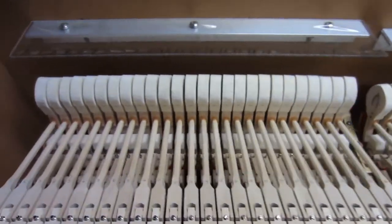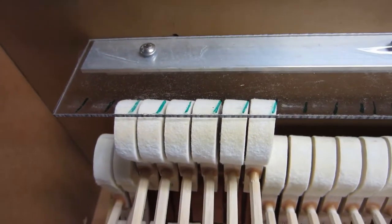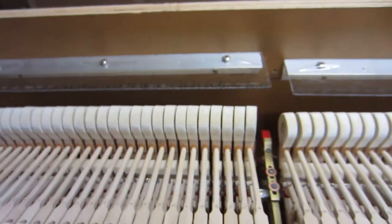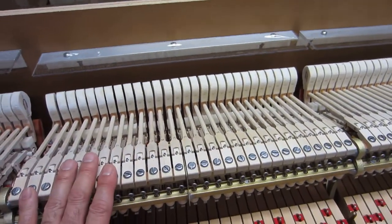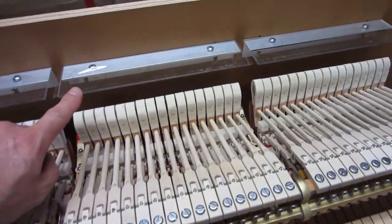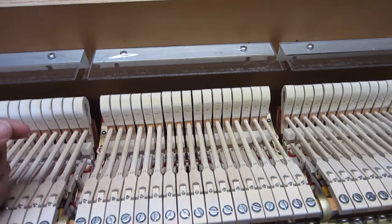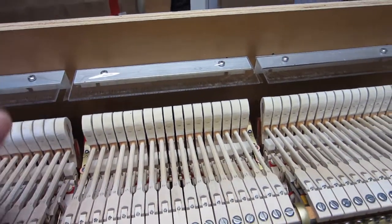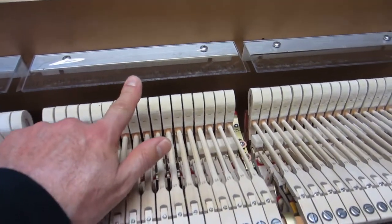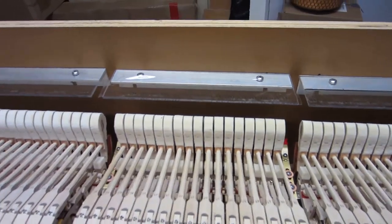Some of the spacing here is really, really far off. As you can see here, I'd barely be touching the bass strings. The reason is I didn't have a real reference when I was just screwing these hammers back onto the action frame. These plexiglass plates here, put on these adjustable shelves that I've designed into this jig, will act as my guide for regulating and spacing your hammers.